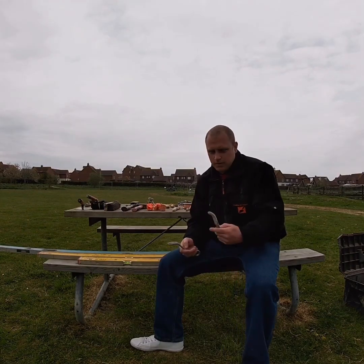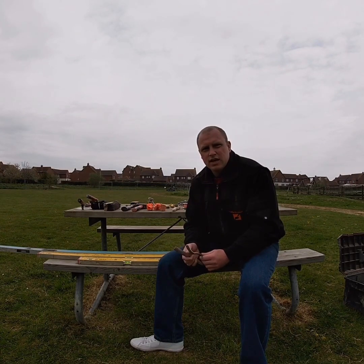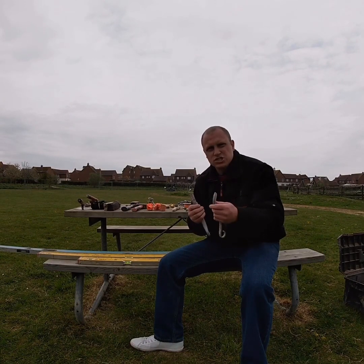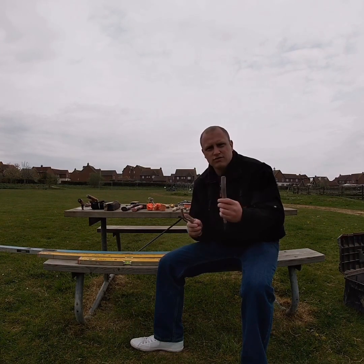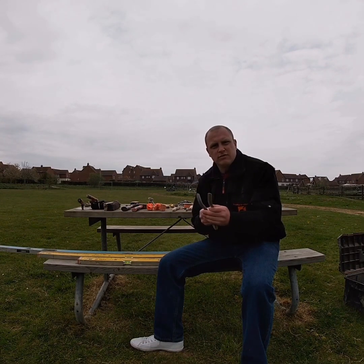Jointing irons now. Yeah, I used to use Marshalltown jointing irons, but these came along on social media. I won these in a competition, and these are galvanized bucket handles, but these are really good. Gives you a nice smooth finish, nice half round joint, and I really like these. I've taken to these more than I have with Marshalltown, so I'll be using these from now on.